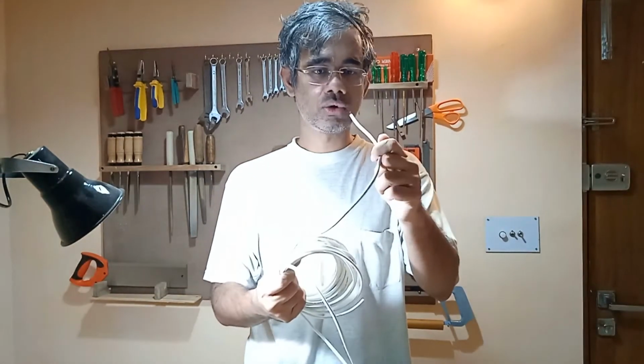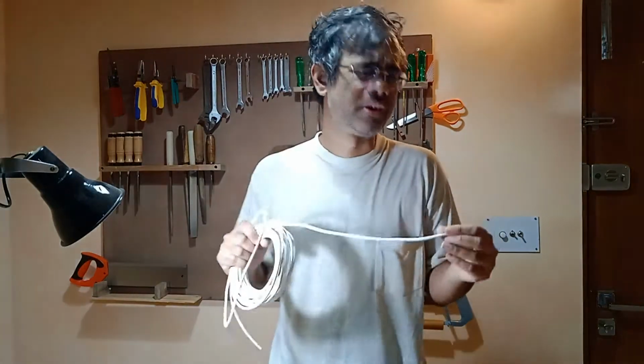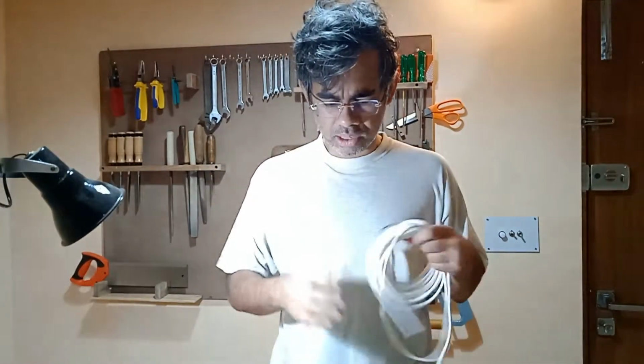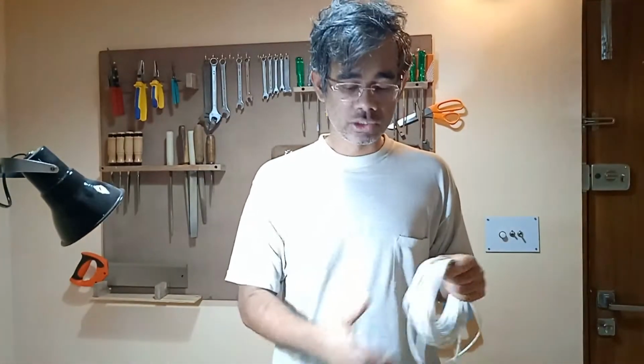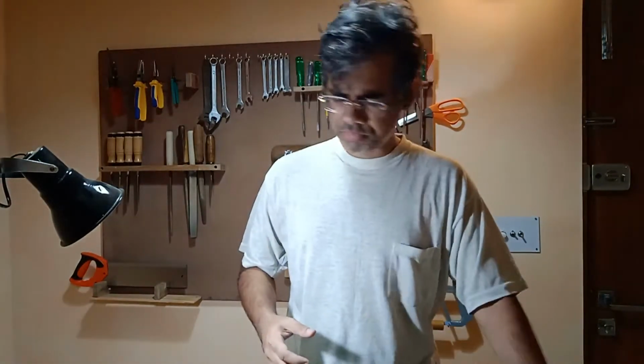Okay. I also needed wires. So this is a twin core wire. I took a fairly good quality one, I like everything to be beefy and over-engineered. You don't need to buy such a good quality wire. Any mains rated cable would do just fine. The way you calculate it is you add up the wattage of each bulb. These are 3 watts, so that's 1, 2, 3, 4, 5, 6, 7, 8. So that's 24 watts. Not a whole lot. Pretty thin cable would do just fine. If you want to go technical about it, probably half a square millimeter for the conductor is just fine.